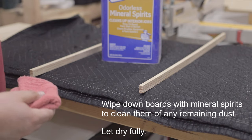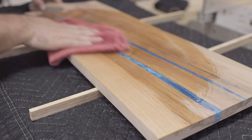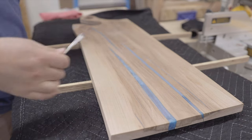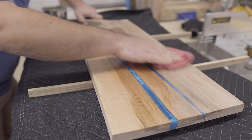Now that your board is nicely sanded and detailed, it's time to finish it. There are a lot of different products you can use to finish charcuterie boards and cutting boards — all of them have to be food safe, which is the most important part. Something as simple as food grade mineral oil is a great finish, but it doesn't provide a lot of water protection, though it is easy to rejuvenate. I prefer a finish like Walrus Oil — I've used their cutting board oil before and also tried their furniture butter, which is a mixture of oil and wax. I found it had a really great smooth finish and the water beaded right off of it.